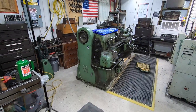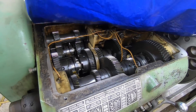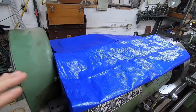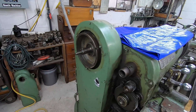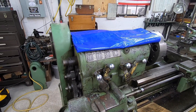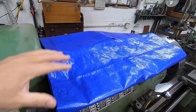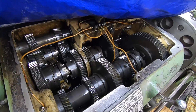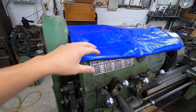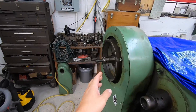I'm going to go ahead and start draining the headstock - I've got a tarp over it to keep dust and sediment from falling in. I want to do an oil change on the headstock, and I may film that as a separate video so we have a Monarch clutch video and a separate searchable video for how to drain the oil in the Monarch headstock. That separates the two subjects and makes each more searchable on YouTube. I'm going to drain the oil, wash the inside of the gearbox, flush it with some kerosene, drain it again, and then refill it with fresh oil.